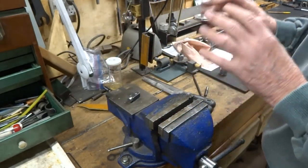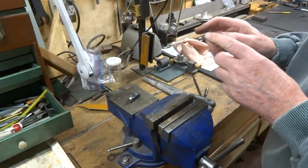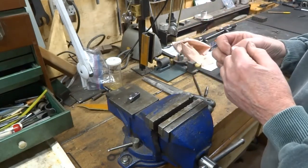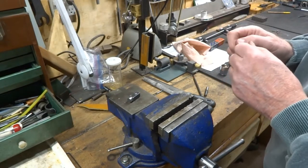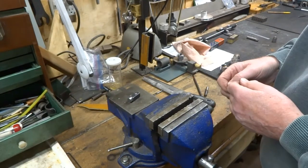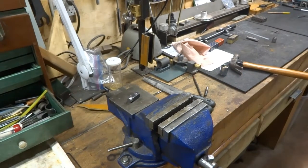Now the only thing that I didn't mention is that sometimes that 1/4 inch drill will drill a little tight. It won't be over 250 thousandths. Most of the time you'll find it will be a little bit over. If it isn't, grab yourself another drill and try again with the same hole, and it'll open it up for you.